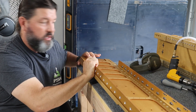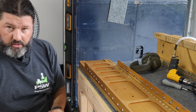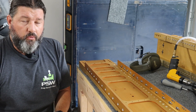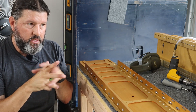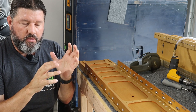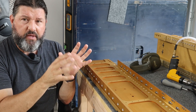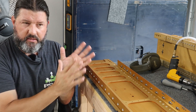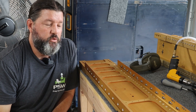I'm going to spray a little self-etching primer into a cup and use a swab to prime all of those countersinks. When that's done, the next step in the plans is to start fabricating the tie-down assembly and attaching the bell crank bracket to the spar. I'm going to try to get all of that done today. If I get even further than that, the next step would be starting to build the skeleton, which I'm excited about.